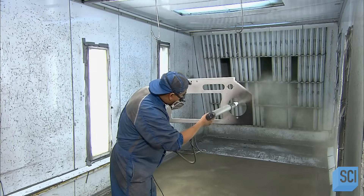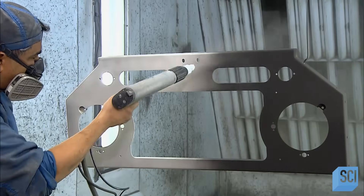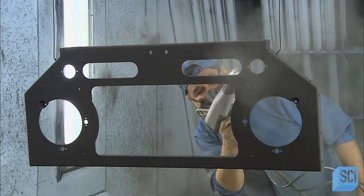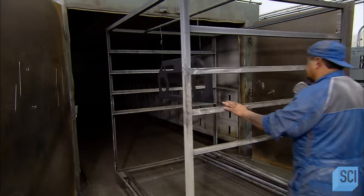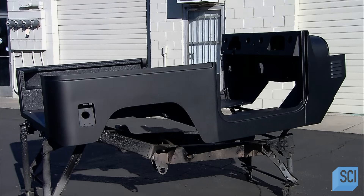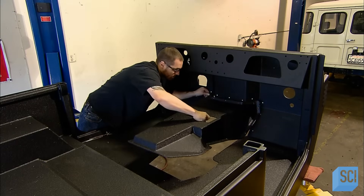The paint is a powder coat finish. It's ionically charged, so it gravitates to the negatively charged parts as it's sprayed. Once baked in an oven, the coating forms a skin that's tougher than conventional paint. They also coat the underside of the lower parts with a heat-cured finish to reduce wear and to muffle vibration.